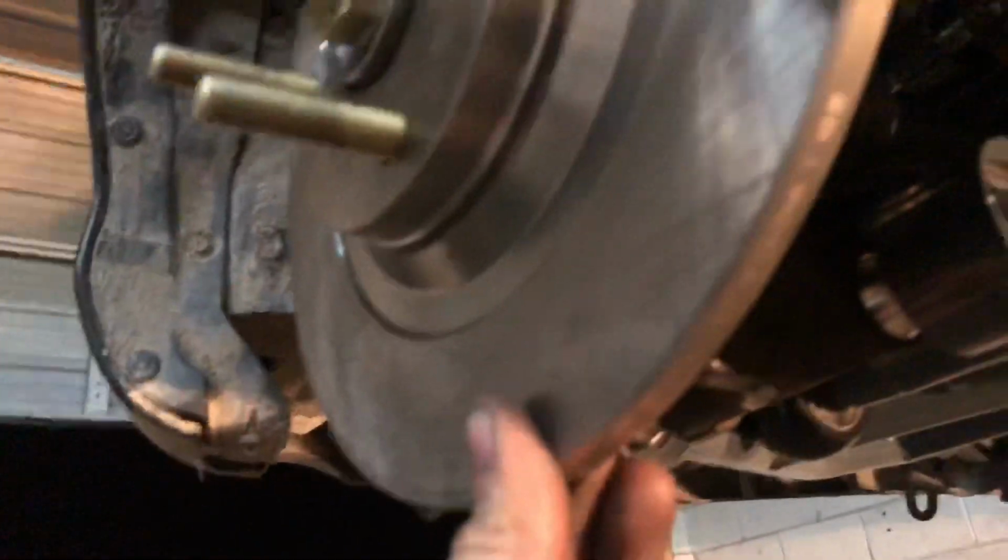Reps. You're really running a non-vented rear rotor? Woo! Risky boy, but some Wilwood 4 pistons and Wilwood 6 pistons? Or 4s? 4, yeah. Oh, 4 pistons all the way around? Well, it's a lightweight car besides a big heavy thing there.